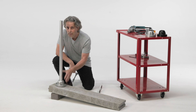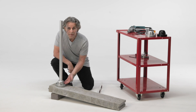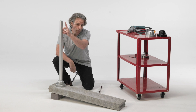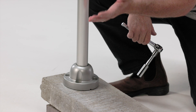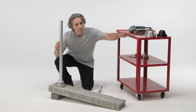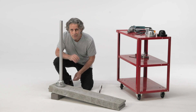If you happen to tighten it down and it's not at the angle you want, don't worry. You can readjust the angle by loosening the nuts all the way, lifting up the assembly, and placing a nut or something rigid underneath to keep the base propped up while you tap down on the top of the post with a piece of wood or a rubber hammer. This will release the inner sleeves from the cap and allow you to readjust the angle. If the angle is off by less than a degree, you can do a fine adjustment using shims supplied with the post base assembly — just place them under one side or the other.